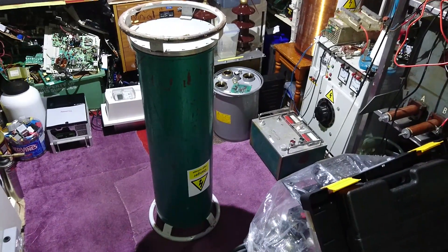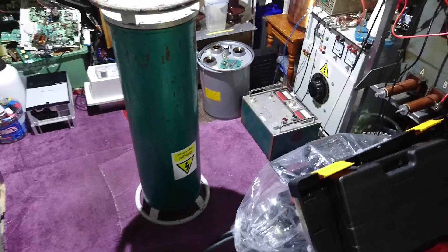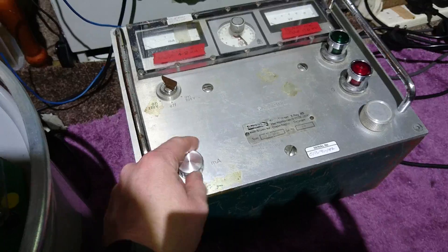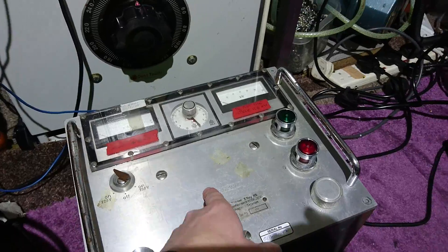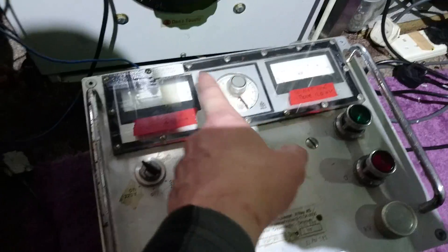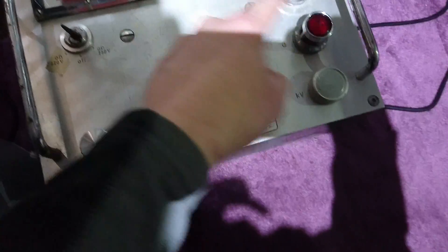There she is — she's upside down at the moment. I'm going to open it up and show you inside. This is 120kV at 10 milliamps of power. Here is the controller as well, which has got a variac in it with a milliamp setting and a kV setting. This controls the power into the variac, which controls the output power going into the transformer. The connectors come back into it showing the kV coming out of the transformer, and this is your milliamps.